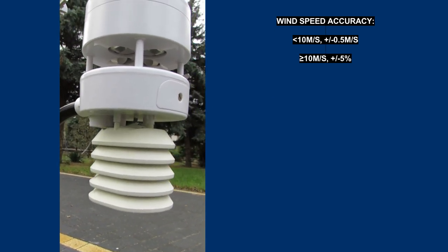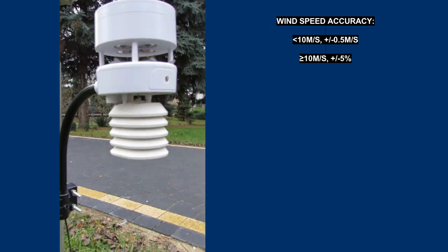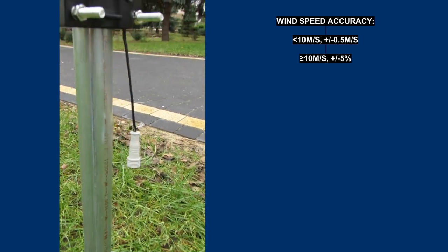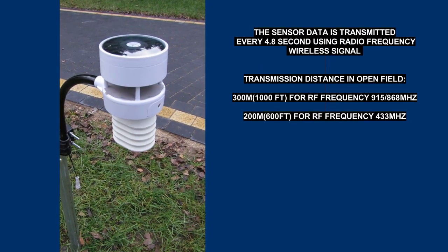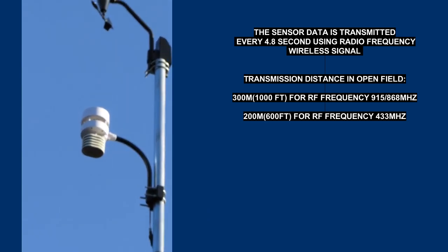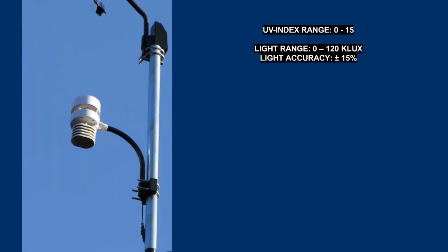Hence the recommendation to use more secure and long-lasting lithium batteries. However, as mentioned, after setup and during normal operation the unit gets its power from the solar cell. As for how such an ultrasonic wind gauge works: it sends acoustic impulses between distant points and measures the difference in sound propagation time to calculate wind speed. More sampling points allow determining the wind direction. The speed of propagation of acoustic pulses varies depending on temperature and humidity, so the additional sensor is needed to more accurately estimate wind speed — that is why it is integrated with the whole sensor.